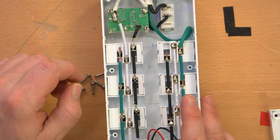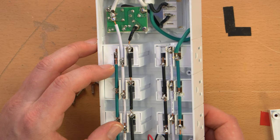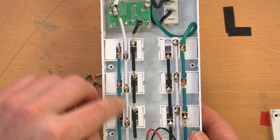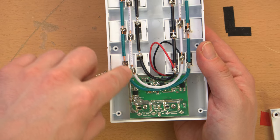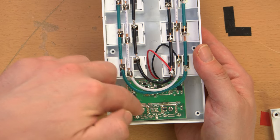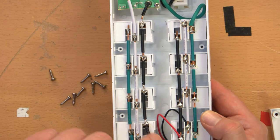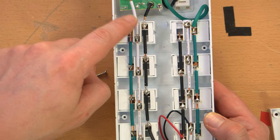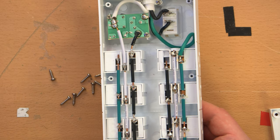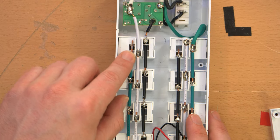It's 16-gauge wire — this automatically gets a fail from me. For whatever your heaviest load is, plug into the receptacle closest to the input rather than the one at the end of the chain, since they just loop around at the bottom. There are two takeoff wires for the USB power supply. The live black wire comes around, neutral comes down and around, and the grounding wire comes in from the other side — nothing wrong with that, just an observation.